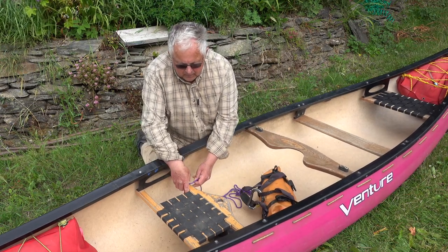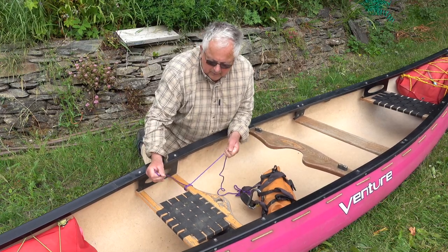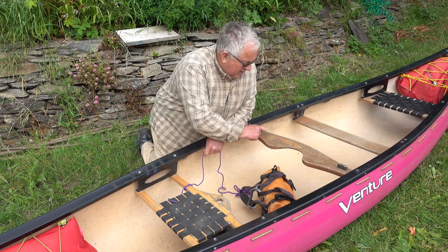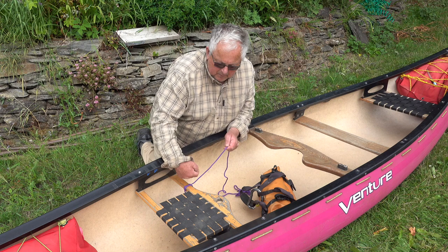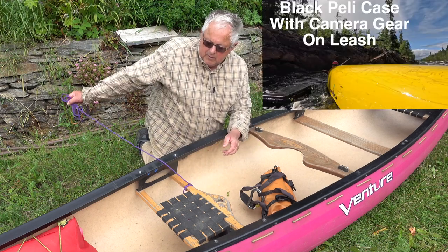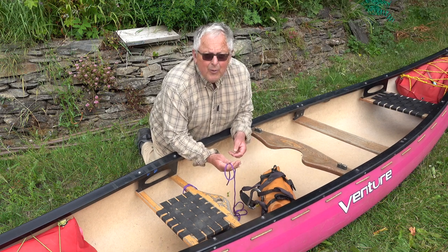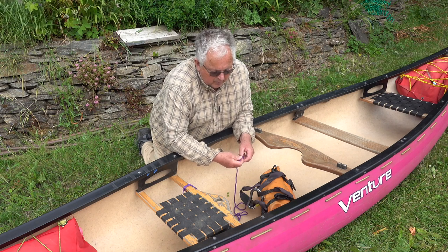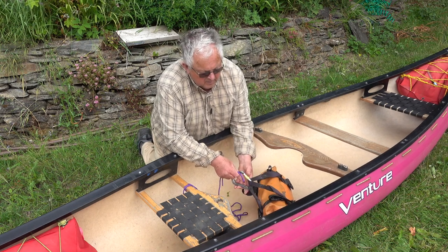So what I'm going to do is tie a clove hitch around the seat. I've left quite a long tail because if you've got a short tail and it gets a bit loose, it can pull itself clear. A clove hitch is probably not the best for most jobs — if I did tie one, I would also then do a number of half hitches up here to make it really secure. I've chosen the length so that it can drift clear of the boat; if somebody's doing a rescue, they can just grab this and clip it into theirs. At the other end, we come back to our overhand knot on a bite — a double piece of rope, over and through. I want a decent tail on it so it doesn't work loose, and then I can clip it in.